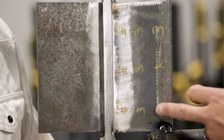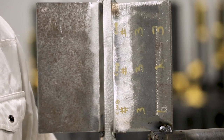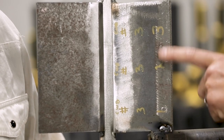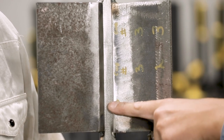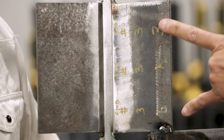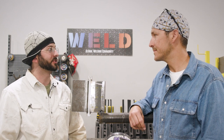On the plates that I've always welded for a weld test, we don't have all these numbers. What do those mean? These numbers here are telling us the position — that big three we're seeing right here. We come from the center out. We've got a number that's usually going to identify the welder. And then we've also got a CWB stamp, and that's just telling everybody that's a CWB stamped plate that you can't take from off the shelf or replace it with anything else. Lastly, we've got our coupons — one, two, and three. These two are going to be a root bend because we've got a stop and a restart here at about an inch and a half up, and four and a half from the top down. So we've got a face bend and two root bends. Y'all do three bend tests for your procedures? Yeah, we've got three. We usually lose about a half inch to three quarters of an inch on each end, and then everything else in the middle gets bent up into three coupons.